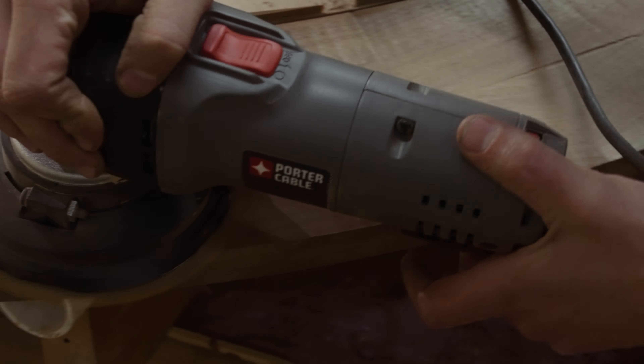Moving on to something I do enjoy — this wood was super old, so it has some rotten and soft spots that I wanted to replace with patches I made on my CNC. Rather than just using walnut, I went with another one of my favorite kinds of wood, sapele. I chose sapele because of the reddish color — it complements the walnut, giving it a contrasty look. I knew once I put a finish on it, the sapele would really pop. The pill shape came from looking at the rotten spots, which were long and skinny, and as a bonus, the patches go the same direction as the grain, giving a tiger eye effect when the sun hits it.